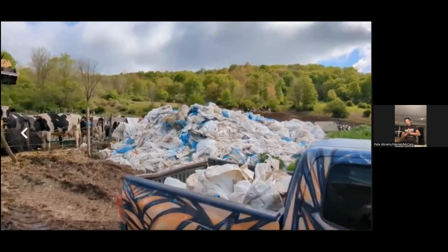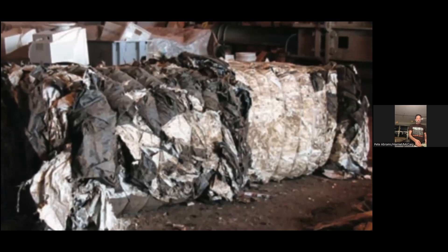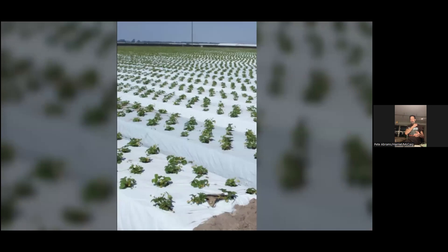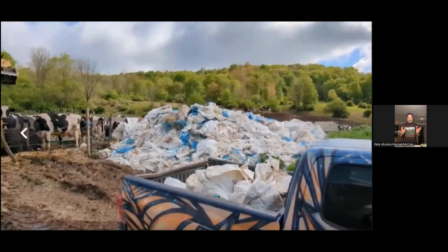Thanks, Carly. So I've been working with different materials, and lately I've been working with plastic and plastic film. Plastic film has very unique capabilities. It's a thermoplastic, which means that it can change with heat, as opposed to a thermoset — basically like a two-part epoxy that will set and you can't do anything with it. A thermoplastic film is very thin, and with just a little bit of heat, you can make it stick to itself.